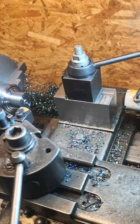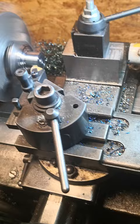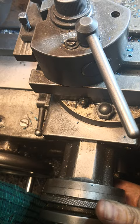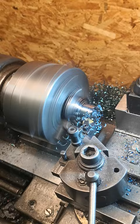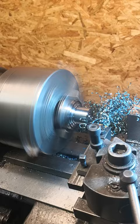Start slowly, of course. Move the carriage — it is now not doing anything because I wanted to check for zero. Now we are on 12, we go to 17, that is 4.5 millimeters inside. I have made this green plastic here so the machine doesn't spit chips anywhere. There we are. Now we disengage the machine when it doesn't stop on its own.